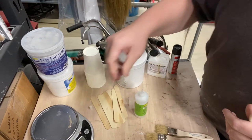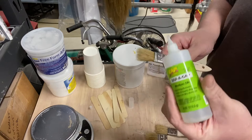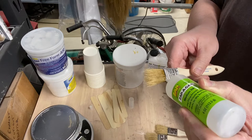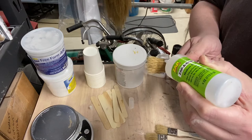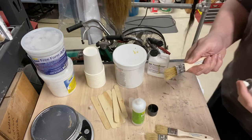If you see them, you can pull them out, and that may happen. But one of the things I learned in the Stan Winston video is that you can just grab some super glue. I don't think they use Zap Gap, they use some other kind of super glue, and you just put a line of glue at the base of the brush. It holds the hairs of the brush in place. So I'm going to do that and then zip kick it really quick. I'm going to do that with about 4 brushes just to prep that.